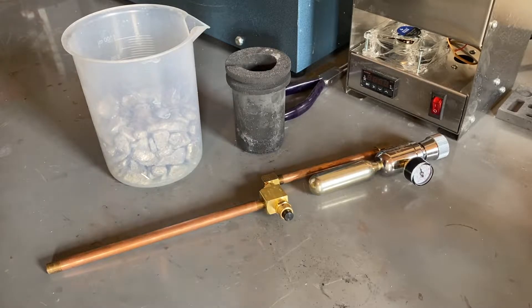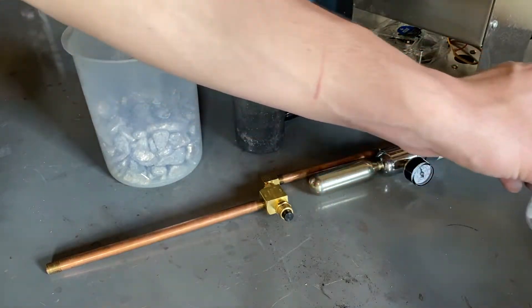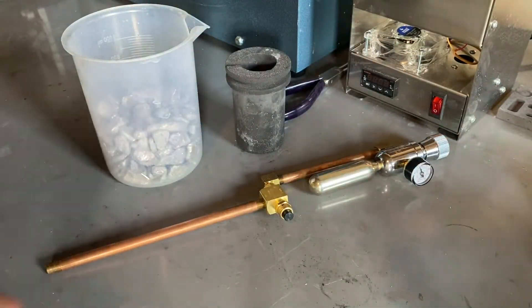In the industrial realm, they use rotary degassing, in which they use compressed gases such as nitrogen, CO2, or argon, and they have a wand or some kind of stirring mechanism that is inserted into the molten aluminum and injects the gas directly — without using intermediate compounds such as baking soda. That's kind of what I've come up with.